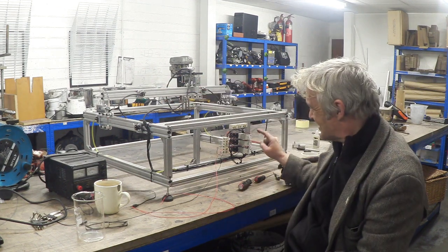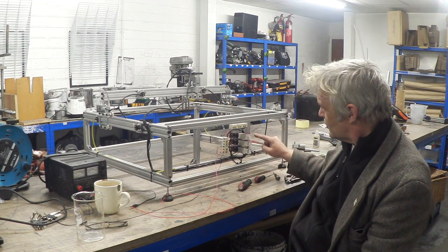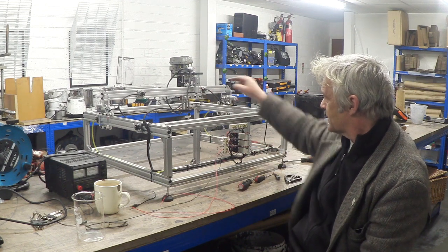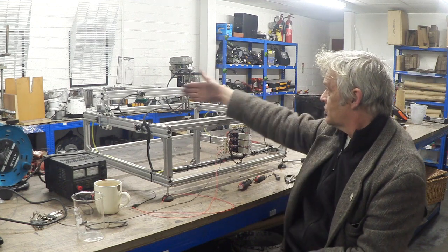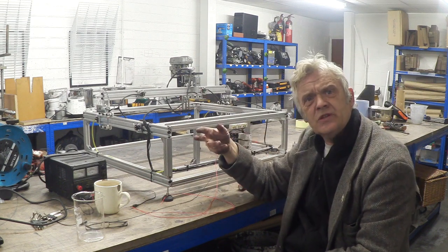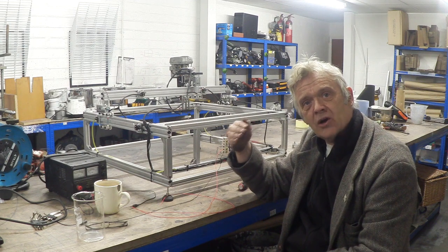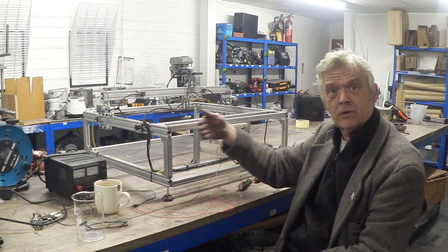You can do that with a double pole double throw switch, or a double pole double throw relay — which is right here. I've got three relays set up to run the four motors. These two relays run the top gantry; this one runs the stage, this one runs left-right, and this one runs the two motors backwards and forwards. When they hit the limit switch they turn off, until you activate the relay to turn it back on, hit the next limit switch, turn off, deactivate the relay, and it comes back. So we have four positions.